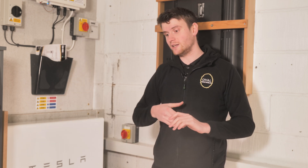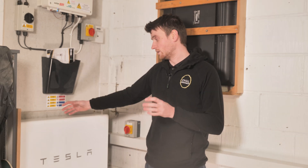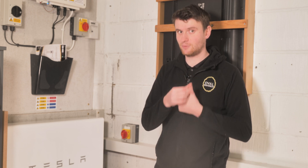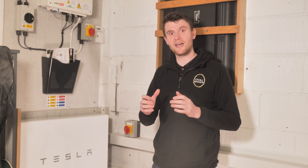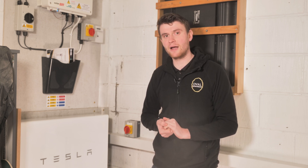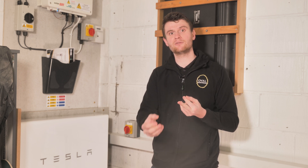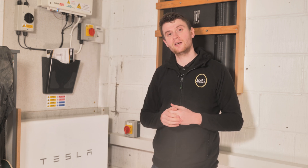Say on the evening you need five kilowatts of power but your solar isn't producing anything — it can charge and discharge up to five kilowatts at any one time. So there are two key numbers: kilowatt hours — 13.5 kilowatt hours — is the amount of energy it can hold; five kilowatts is the rate at which it can push energy out or grab it into its battery cells. It's important when comparing battery technology not to confuse those two numbers.